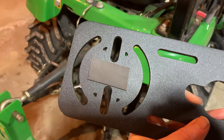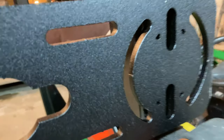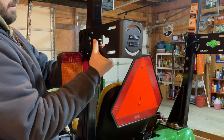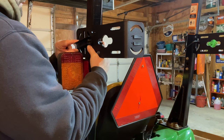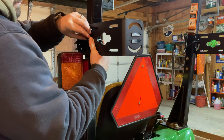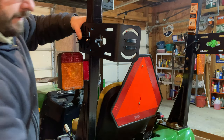At this point I had to turn the heater on in the garage, I was just getting too cold. You can see I've put that little adhesive strip on the side of the ROPS mounting bar, and it uses U-bolts to mount onto the sides of the ROPS. There are a couple of different ways you can do that — you can do it from the inside with the U-bolts on the outside, or the bracket on the outside and the U-bolts on the inside. Now it would be handy to have an extra set of hands here, but I show here that this entire installation can be done by one person.